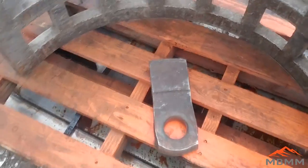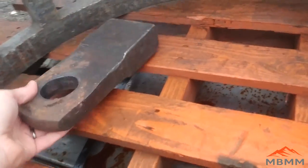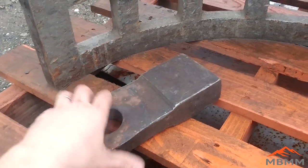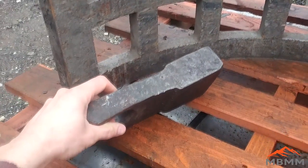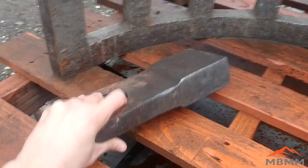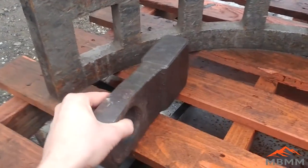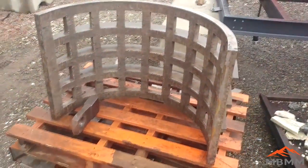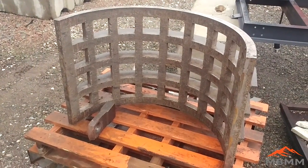Here are the hammers — we pulled one out so you can see there is very, very little wear. They're drop-forged manganese steel for extra long life and they work-harden. There were some concerns on some of our earlier YouTube videos about wear on the machine, but you can see now after running samples through the mill and through the screens that the wear is pretty minimal, and I think it's going to last a long, long time.